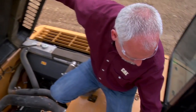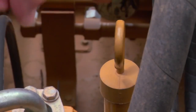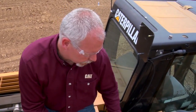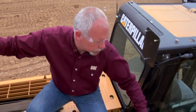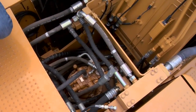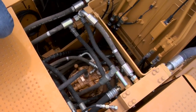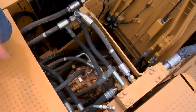Right over here to my left, down in this area, I have a dipstick for my swing motor oil. I need to check that and make sure there's oil inside there — if not, bring it up to the proper level. While I'm up here, I'll look around; if I see something that's wet, oily, or leaking, I'll want to check that out before I start operating. Otherwise, I'm going to head down and start the ground-level walk-around.